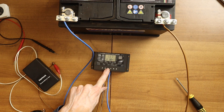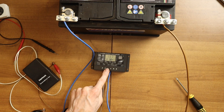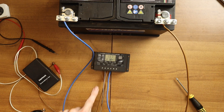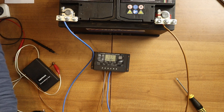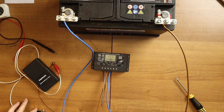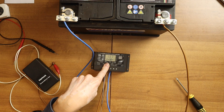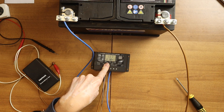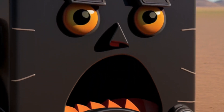It's going up to 13.7 volts. And what you see now is flashing — that means the voltage went up from what was before 12.7, now to 13.7. In the manual there is a setting where you can say this is the voltage where it has to charge slower. This flashing means it's charging slower, so that it will not stress the battery when it is close to the fully charged state.